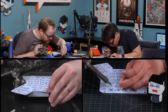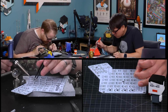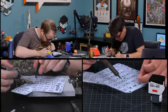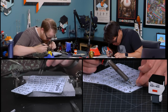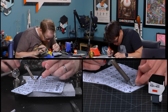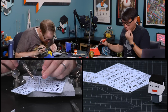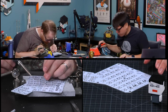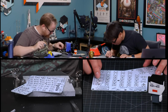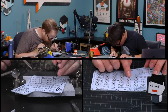I'm gonna replace that one. Wow. I think if we were good at this, we would probably be much faster. In fact, I'd say there's probably people in the comments screaming, "Oh my God, look at these assholes!" If you're using a flathead, use the finer tip. The tips are one of those things I always look at when we go into people's shops, and almost everywhere we go, people use the fat flat tip. I have it on good authority that goes all the way up to Apple and Google and places like that where they have people who should really know what they're doing, and soldering irons that are thousands of dollars. Yeah, not pretty, but...